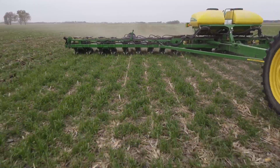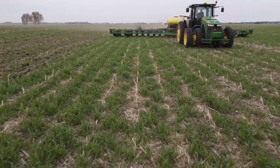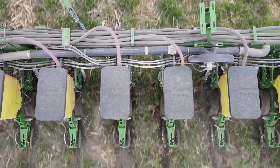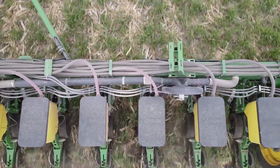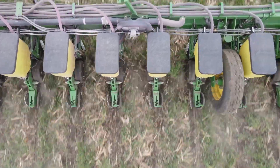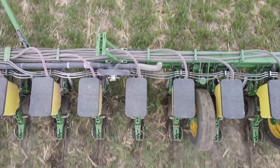We wanted to transfer the Delta Force and the Clean Sweep with the floating row cleaners over to another planter, but we also wanted to get central fill. We started looking at new planters and went to our regular dealer where we get all our tractors and implements. We priced out a new one OEM with hydraulic downforce, and we also wanted electric seed meters and central fill. We didn't have the electric meters before — we had hydraulic drive with two-row shutoffs. The electric meters would give us every-row shutoff, and with the hydraulic downforce it's like we have 24 individual little planters. We went and looked at: brand new, central fill, electric meters, adjustable row cleaners, and hydraulic downforce.